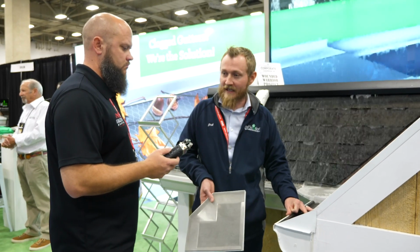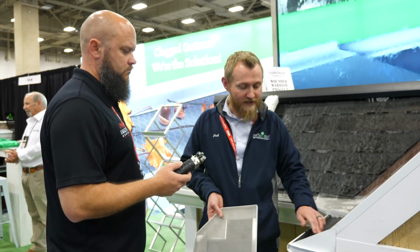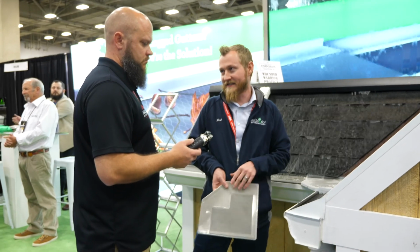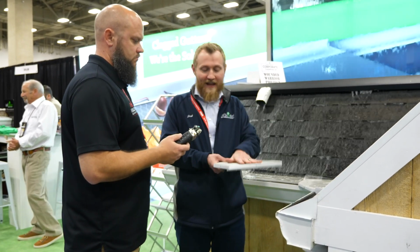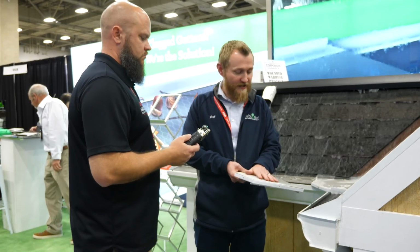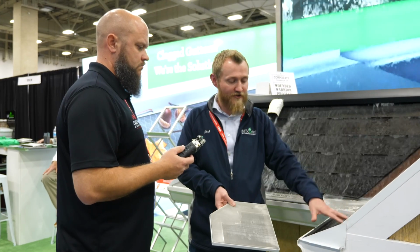This is important because a perfect circle, water will bead on. The raindrops are odd shaped and will break the surface tension and draw the water down, which is why it can intake so much water. The waves that are rolled into it are to make sure it's not a flat piece of metal surface like a lot of its competition, because flat metal will allow the leaf to just stick on there and not dry up and blow off.